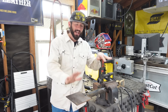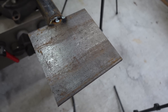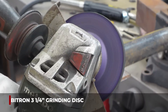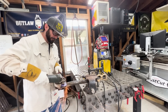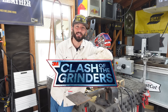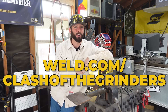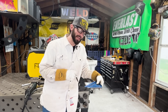Now that the machine is ready, I noticed something, Mr. WizBoy — you didn't bother prepping this plate. We've got a piece of quarter inch mild steel with all the mill scale left on it, just like you did. I really recommend getting all that mill scale off with a grinding disc or at least a wire wheel. Get that material clean and you'll notice a much prettier looking weld. Speaking of quality prep, stay tuned for Clash of the Grinders later this year where you can win up to $15,000 cash — find out more at weld.com.